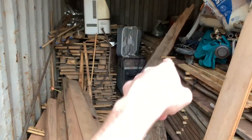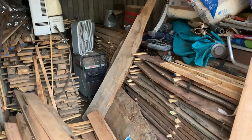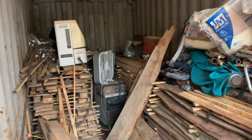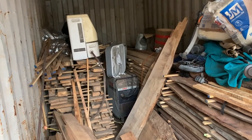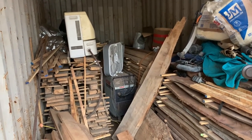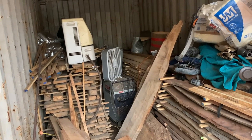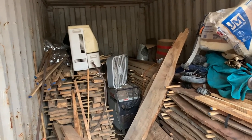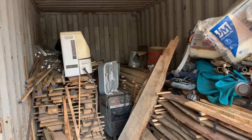That's white oak. That back there is pin oak. Most people don't use it, but there's a big old tree that fell down in a storm. I hate to see it go to waste, so I'm actually using that for all my base trim. I'm staining it dark, so you really can't tell. It has real dark lines. It's got some fungus in it from as it was growing. It's common with the pin oaks. The grain's real fat, so a lot of it's quarter sawn. The grains are like twice the size of the red oak. So it did okay. I did my base trim in a couple of my bedrooms, and I put it up next to the red oak, and it's a little bit darker, but it's fine.